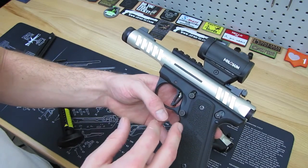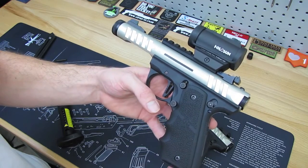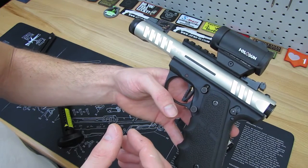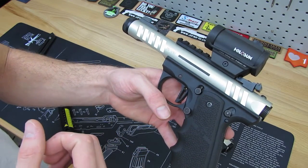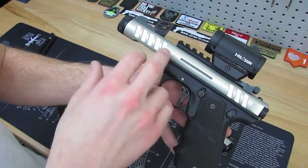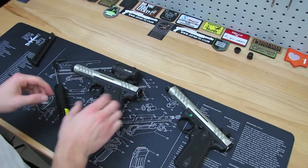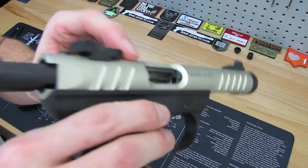Bear in mind that all the stuff I upgraded from Tandem Cross should not actually decrease your trigger pull. They say the hammer bushing can do that - replacing it because you're removing those springs and extra pieces that require the mag to be in to pull the trigger. Removing that can reduce your trigger pull, but I think it would be negligible - you probably wouldn't really notice much unless it was on a digital gauge. If you watched the other video, I polished a bunch of internals - polished the sear, polished the trigger bar - and that is where you're going to get the reduction in trigger pull.